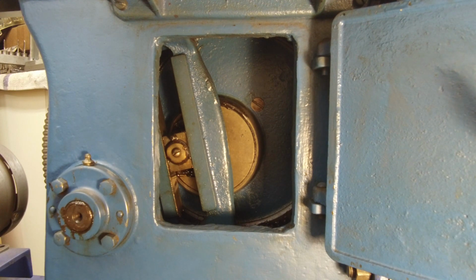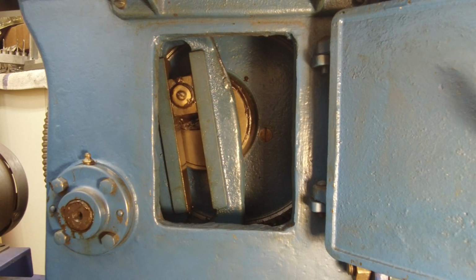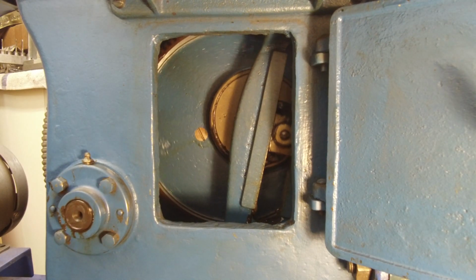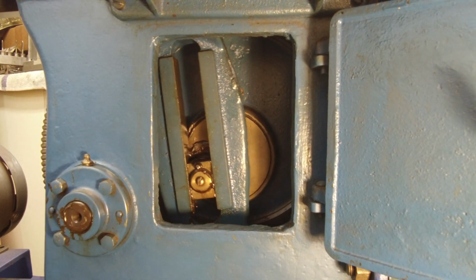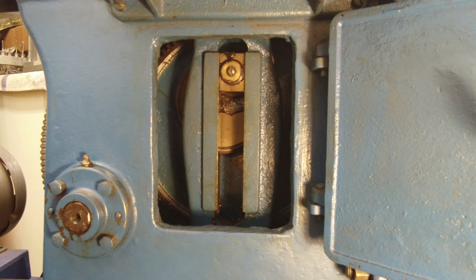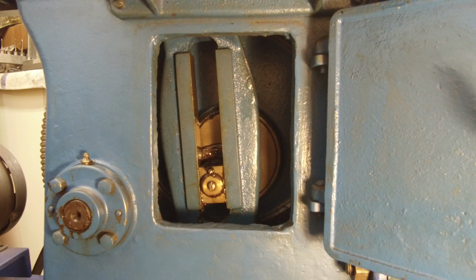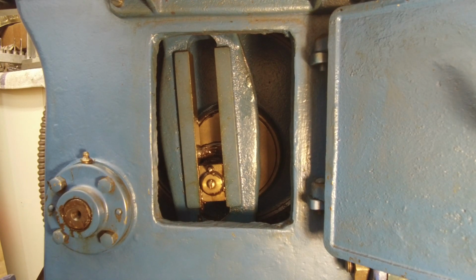Now I'm going to go ahead and rotate this around, and you see how that cam is off of that center piece, but as it goes over the top, it takes longer to go over that top than down here at the bottom, because it's short towards the pivot. Remember, the pivot is at the bottom of the machine and the ram is at the top of the machine. Alright, now I'm going to drop the belt down so that you can see it move under its own power.